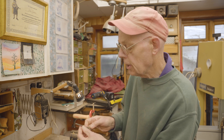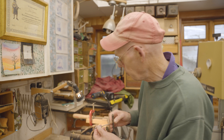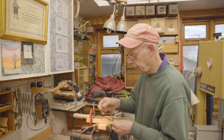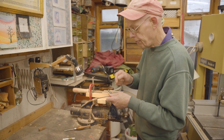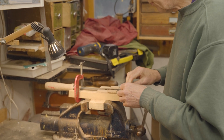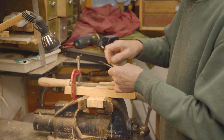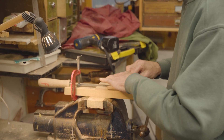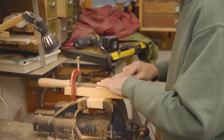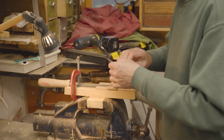To make it, it has to be consistent on both sides. The rather nifty way I worked out — this is a smaller diameter, this would be for a D1 — is get a file, get the length of silver steel or whatever that will fit inside your staple. File a flat on the back so it's always consistently in the same place. Tighten it up on this tap holder and then you can sharpen that side. Blacken this first with the felt tip pen and then on this side as well. Because you've got the felt tip pen mark, you're going to be able to see how each side is equal so that the profile on either side will be equal.